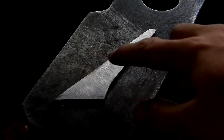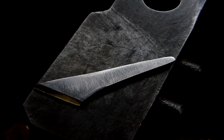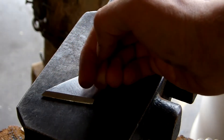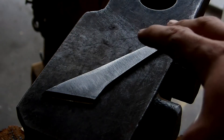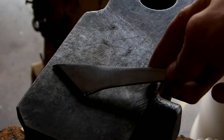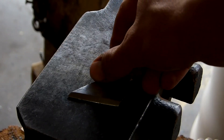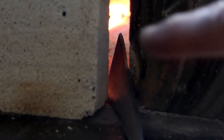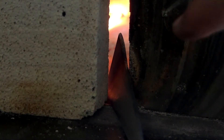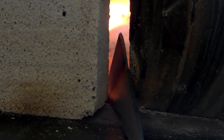The bevel is all filed up nicely, and now comes the scary part: hardening. On this particular piece I'm only going to harden the edge and a little bit back behind it. I've never done this type of hardening before — I've always quenched the whole blade, tang and all. But for this piece with a single bevel, it'll be best to just harden from the tip to about here. I've got just the edge sticking in behind the forge doors on a nice low heat, and you can see that straw and steel blue starting to come up the edge.